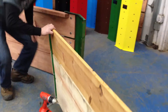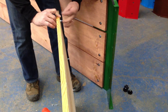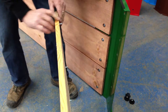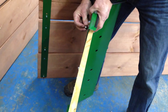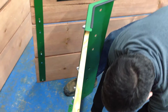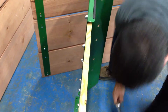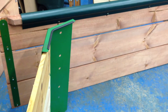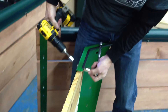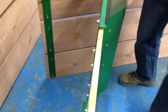Your upper stud is going to be on the top hole in the wall, and then the supplied nut that comes with it — called the retaining nut — is going to hold it in place. Hold that there for now and we'll come back to that side in a minute. Then you simply put your two nuts and bolts through the top hole first, and then do your bottom hole. Go hand tight to start with until you get both nuts and bolts in, and then use a ratchet on one side and a cordless drill to tighten it a little bit faster. So now we've got both nuts and bolts tightened, so that side's done.